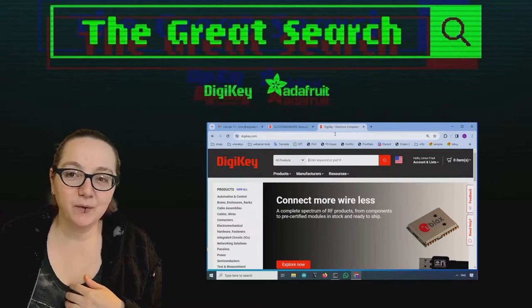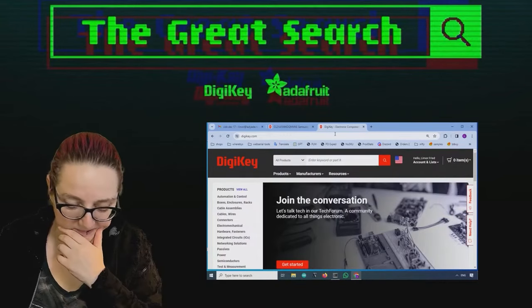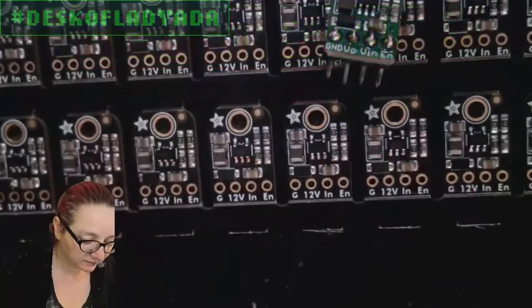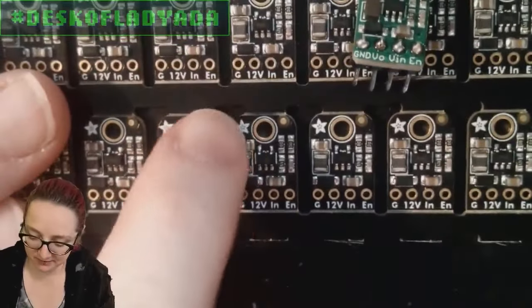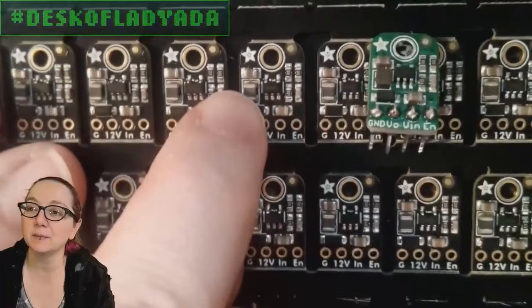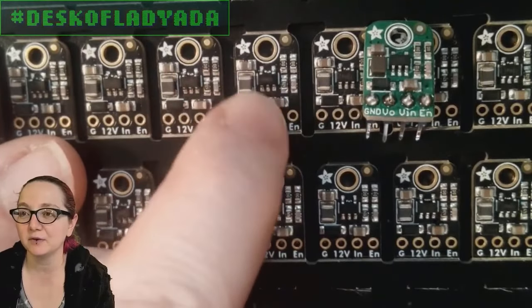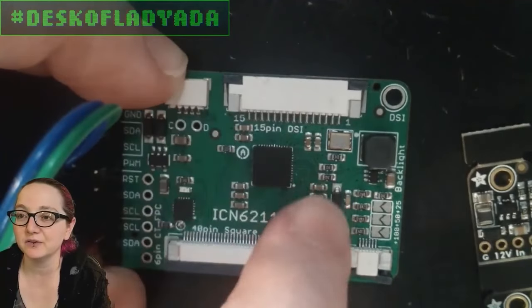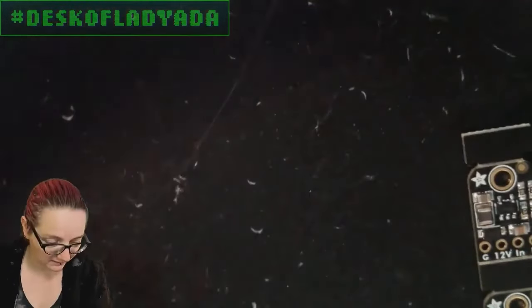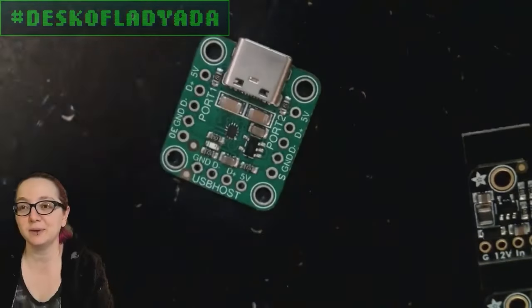Well, what I thought I would show off was actually just 10 microfarad capacitors. If you go back to the overhead, I've got 10 microfarad capacitors here and here. This is a little buck boost converter to 12 volts, so these two big caps here are 10 microfarads. And on this board, all of these chonkers are 10 microfarads. This was a design where I had two 100 microfarads, turns out too big.